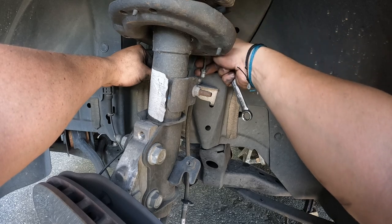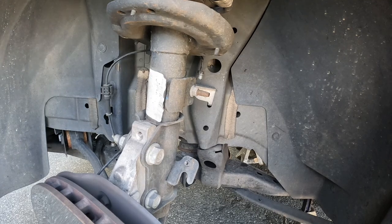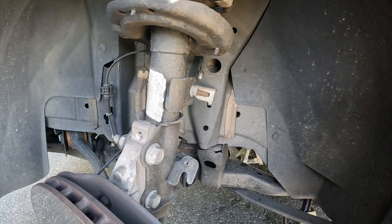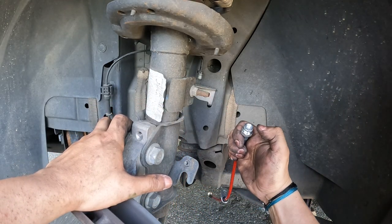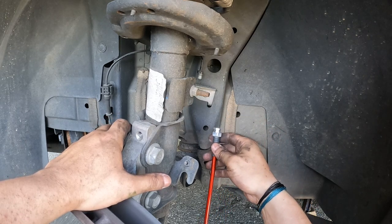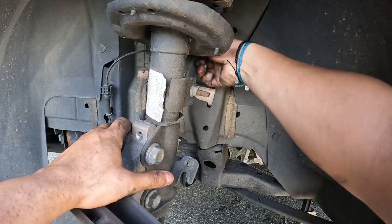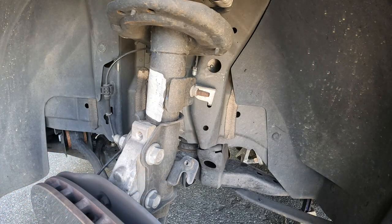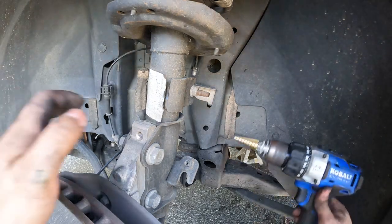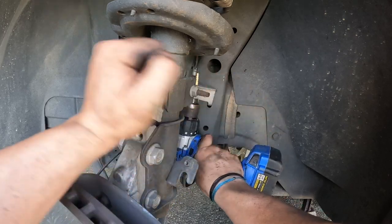All done. So we got the new braided stainless steel line we're going to be putting in. I want to reuse that hole, but it doesn't fit — this line is 5/8ths. So we're just going to get a unibit and widen this up just a little bit. Get your unibit and drill — that should do it right there.